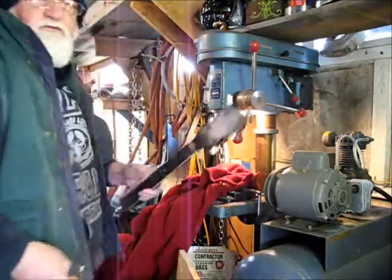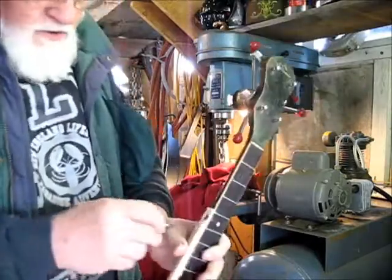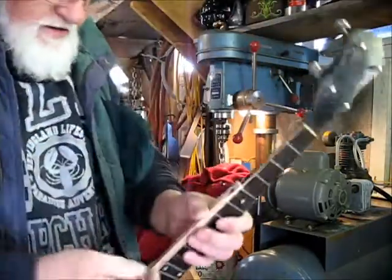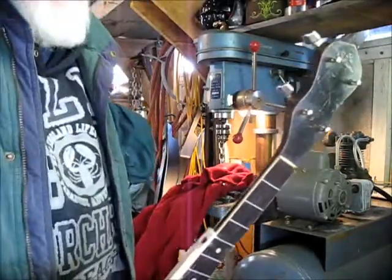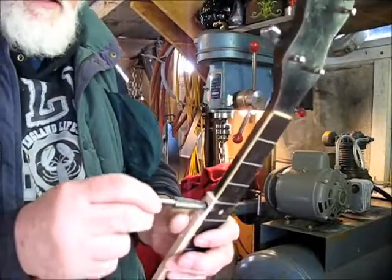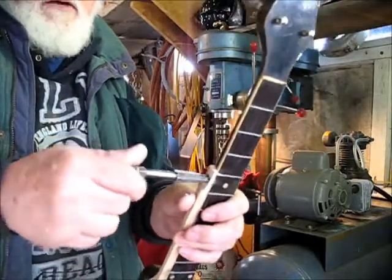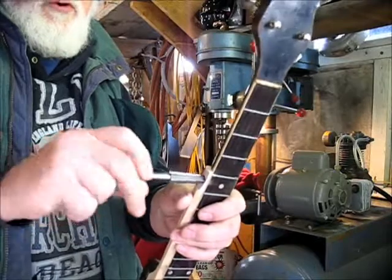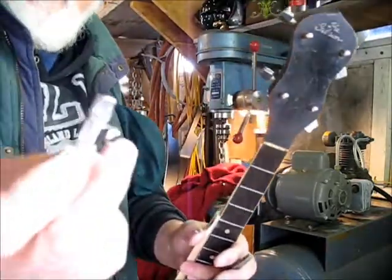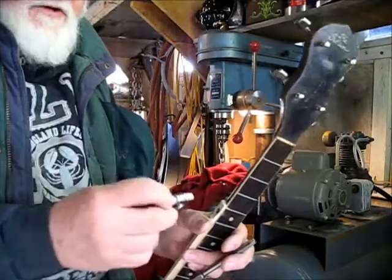Generally what I like to do is drill my hole a little smaller than it needs to be, just so the end goes in there. Then I use this tool called a reamer — it's basically made for a banjo peg. I put that in there, get a wrench on the far end, and just turn it. It reams the hole out because the peg is angled, not straight.